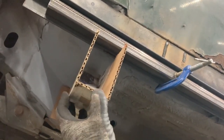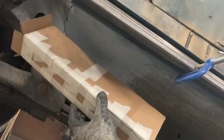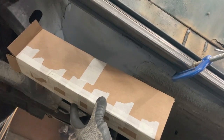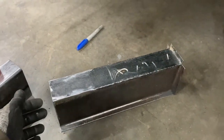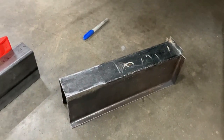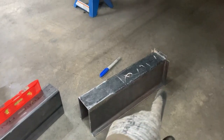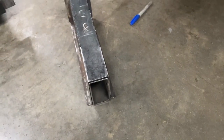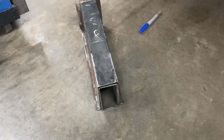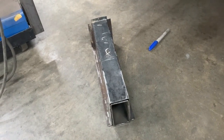This sleeve has to go in here, and once we determine where it needs to go, we've got some metal work to do on the front and back. As always, start with a cardboard template because you can fabricate and alter it easily to figure out what you need to build, and then build it out of metal. So far, this is my first attempt at the metal sleeve I'm going to install. It's all flat metal — I measured it and then formed it. The sides have formed lips on there, and then it's separate from that lip on either side. I basically wrapped it around our metal here, used some C-clamps, and just tack welded it here and there. Once we figure out where to put it, we'll install it — that's the next part to work on.